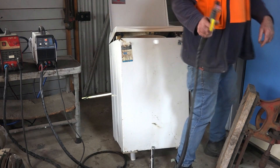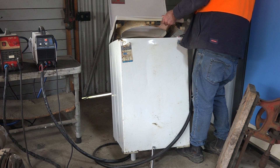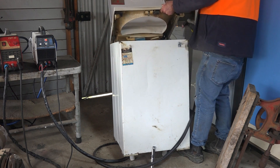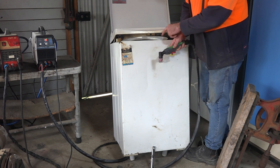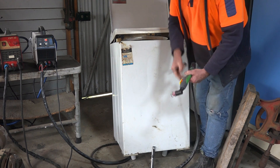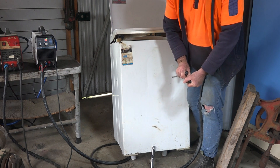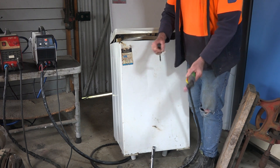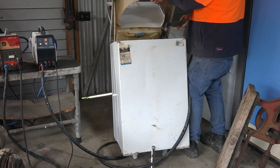Come around the other side. The only thing I don't like about this is it's got a guide on here, and it's alright when you're cutting flat metal plate, but when you're trying to do plasma cutting like this - getting into corners and other bits and pieces - it's not that flash. So what I do is I just take the guide off. The standoff guide on this is quite tight so I'll have to use a screwdriver to flick it off. So we'll see how it goes without the guide on it - I should be able to get in a little bit closer and cut the stuff. Just gotta watch how close you hold it.